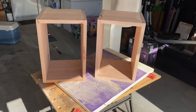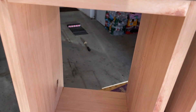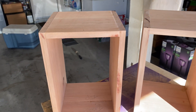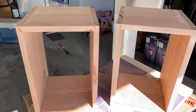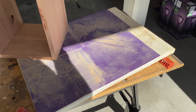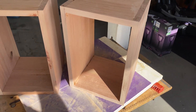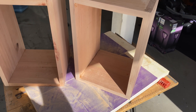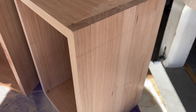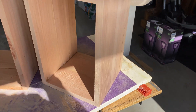It's starting to look a little bit more like speakers. These are the cabinet frames put together, and you can see it's not perfectly flush — as hard as I try I can never get it perfectly flush with the tools that I have. So I've created this — I saw somebody do it on YouTube — it's just a pizza stone with sandpaper, and what I do is run the face of this across it. It's a nice perfectly flat surface and you don't have any rounding of the edges.